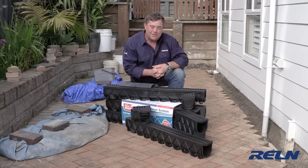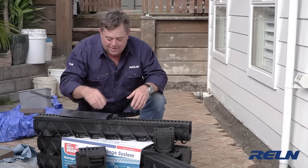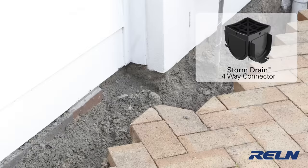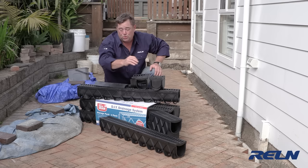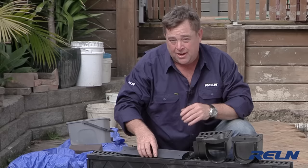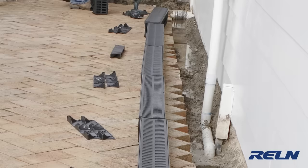Instantly you've got problems there. By the end of the day it'll look smart, move the water away and work smart as well. So what products do we exactly need? I've got two DIY kits which gives me eight meters of drain — from the edge of the house to where it kicks out is exactly eight meters. Then a 90-degree corner and a four-way connector to get around that kink, and I'll connect to an in-line pit which lowers the water so gravity carries it away. Because it's an eight-meter straight line, I've got these joiners to stiffen it up, give a nice straight line, and make it stronger and look better.